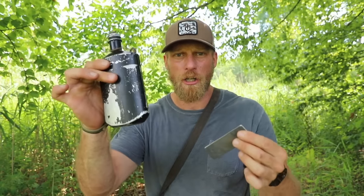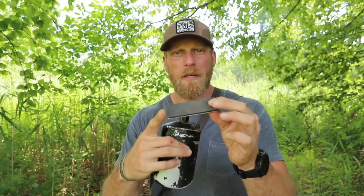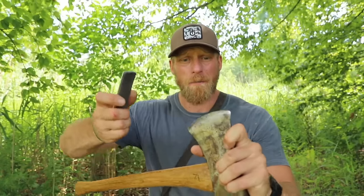So a small sharpening stone. We're going to use water on our stone always, to work as a medium to catch whatever we shave off or grind off. When we sharpen something, we're removing metal — we don't want that metal to get trapped inside the pores of our stone. Putting a little bit of water on here, because it's everywhere in the field, works really well. It'll become a slurry and you just wipe it off at the end, and your stone stays good.